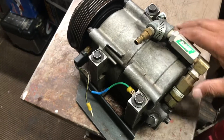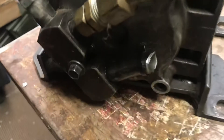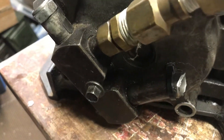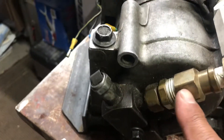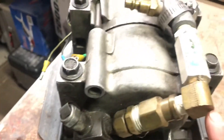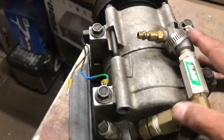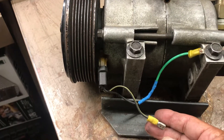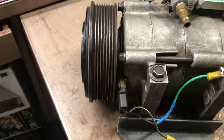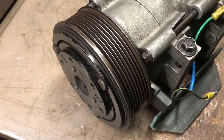For the simplest setup: if your air conditioning isn't working, cut the lines in the back, put on a compression fitting first, then thread it out to whatever elbows you need to get a quick connect fitting on here. Then all you have to do is get 12 volts to lock up this clutch so it pumps air. I think that's it.